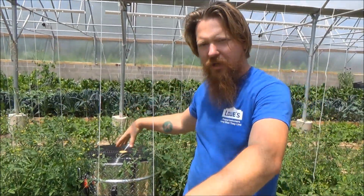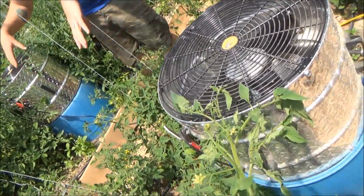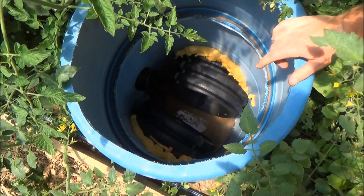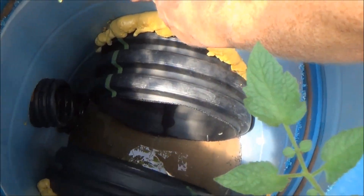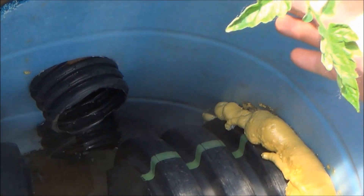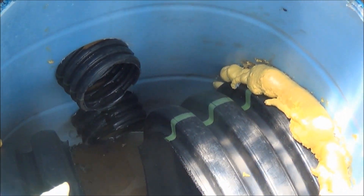Here at this point in the greenhouse, we have two fans that go into these barrels, which go into the ground. There's a large pipe in the ground that's a manifold that feeds into all the smaller pipes. Here you can see our exhaust barrel — at either end of the greenhouse, in each bay, we've got an exhaust barrel. These large pipes are connected to all these small pipes. From the end where the exhaust fan is, it blows under the ground at two layers — one pipe at 30 inches, one at about 15 inches, repeating every two feet connecting into these large pipes. It's really a huge underground exhaust system.